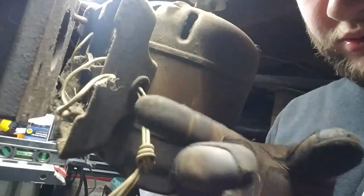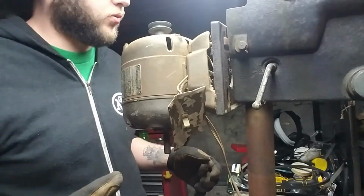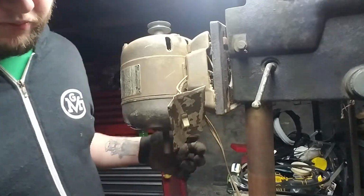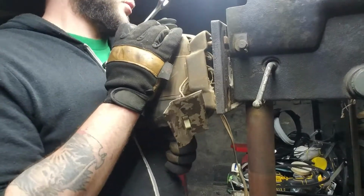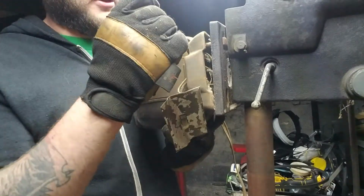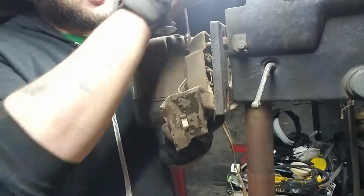But looky here, it's been stripped back, and you notice how flat it is. That was just sandwiched between the base of the motor and the backing plate here. Nothing inherently wrong with it. Most tools or machinery grounds to the casing, but most modern tools have an actual bolt and eyelet that it attaches the grounding strap with, rather than just smashing it between two pieces of metal on the casing. Like I said, either way works. Not really a problem. Just amusing.